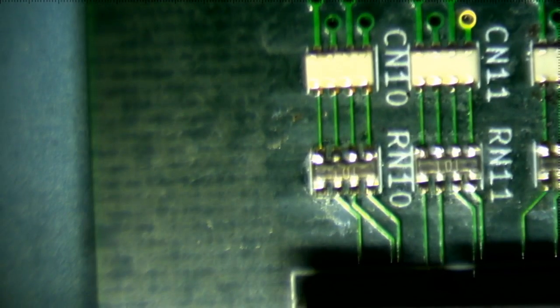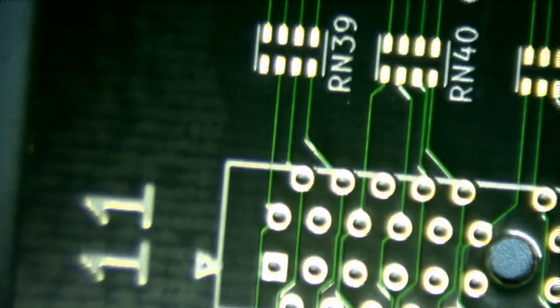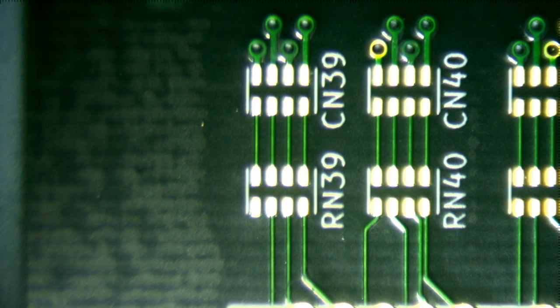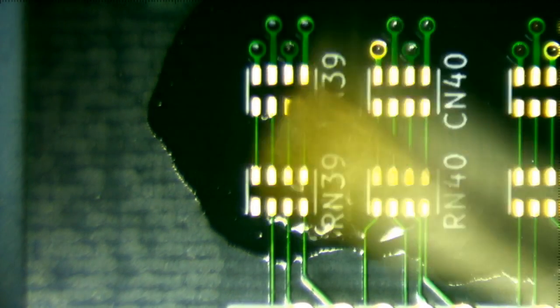And then these capacitor networks, of course, surface mount capacitors, unless they're electrolytic, usually don't have any markings whatsoever. These are the terminations for every signal on the board, on the backplane. And if you look on my channel, you will see a multi-part investigation into signal termination. And this is why I have termination, because it makes the signal edges cleaner.